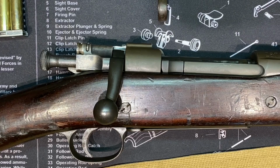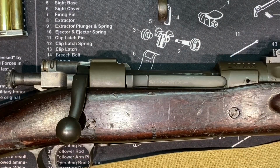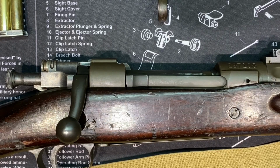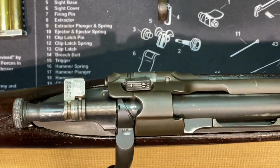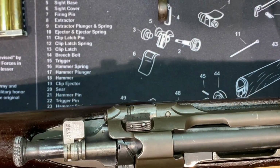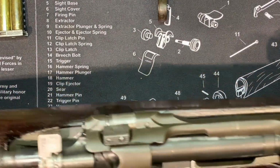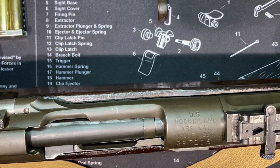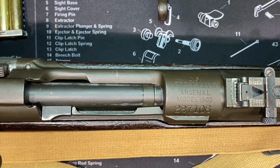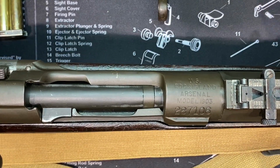And Springfield Armory also had some issues. They have their own numbers that you'd have to research, where they realized there was some kind of problem with how they were doing the heat treating. They were basically eyeballing the heat treatment process, and that wasn't a good idea because, as good as these guys are, or as good as that worked around the turn of the century, by 1917 there were better ways to tell when the steel was ready to be quenched, or how hot you were heating it. It's very important for strength.